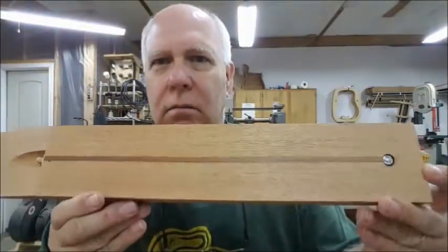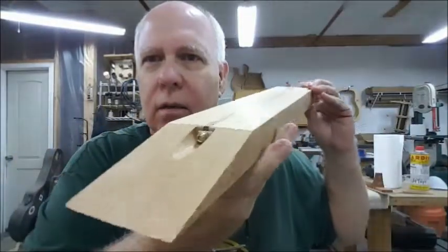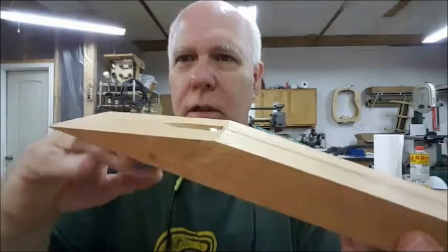I've gone ahead and installed my filler strip, glued it into place, and then took a block plane to bring it down to just about the surface of the top of the neck. I used my belt sander — not powered, just ran the neck across the belt — and then used a card scraper to smooth it out and complete the process. So I'm done with the truss rod installation and it looks pretty nice. The next step will be to glue up the rest of the headstock, glue on the heel blanks, and then start carving this neck and installing it onto the guitar body.